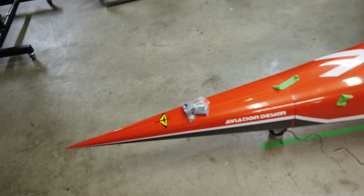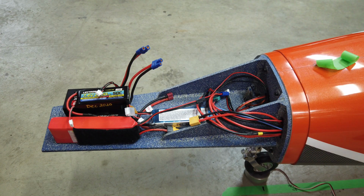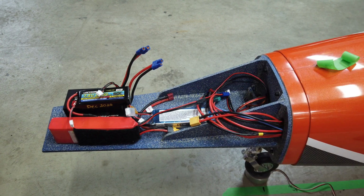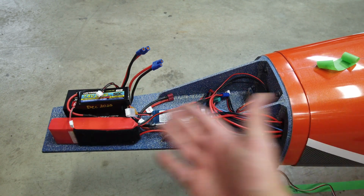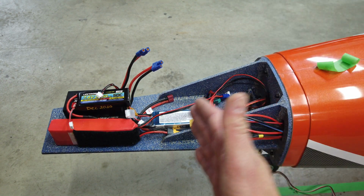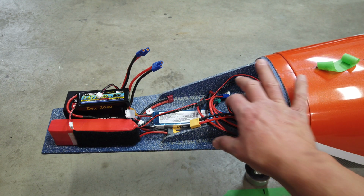And all the batteries are essentially moved forward as far as they can go. I'll show you guys what that looks like. So that's the battery setup. As I've talked about already before, I was worried that the turbine battery would not end up in the nose, but clearly it did end up in the nose, and we could upsize all the batteries, but we don't really need to because they're all very sufficient for what needs to be up there. So we're going to have to add a bunch of lead in the nose, which is totally fine. This plane's never going to know the difference.